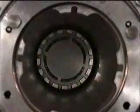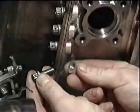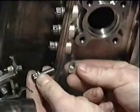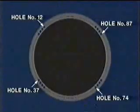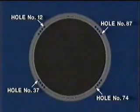Next, fit the locking cap back into position and secure with the internal retaining ring. Now the flange can be bolted up. First, fit the 16 special nuts and bolts next to the number 2 nozzle guide vane cooling air bosses, and fit the 7 brackets in the correct positions.